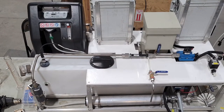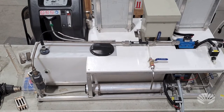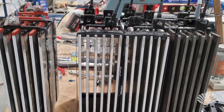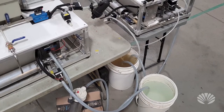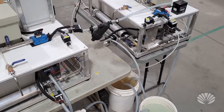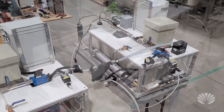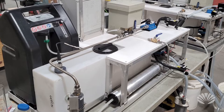There are a few processing units, and basically what this does is use a couple of different processes. One is called electrocoagulation, which is a process invented back in 1958. It uses several metal plates closely spaced together — you pass an electric current through the plates and then pass the wastewater liquid through the gap between the plates. All the particles in the water coagulate — they group and clump together.